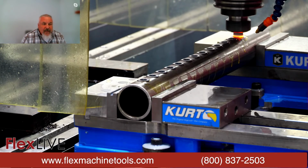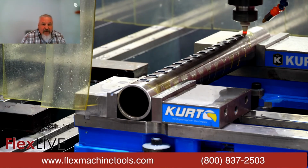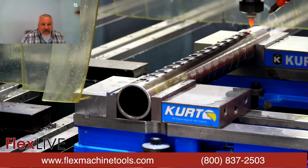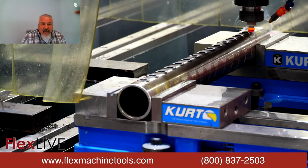We offer, again, 2 styles of flow drills. We have our standard that leaves what we call a collar. That's what is being demonstrated here. It leaves that upset material. We roll it over and it makes a neat little, almost like a washer, if you will, on that top side. The second style flow drill bit we offer is called a flat style.